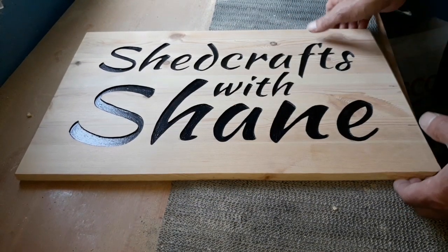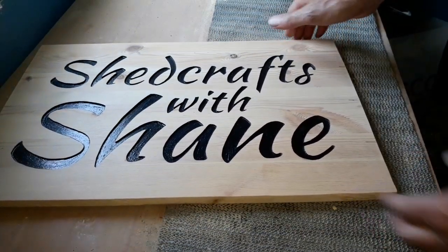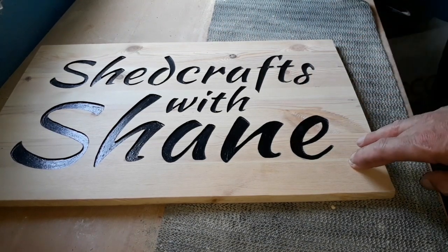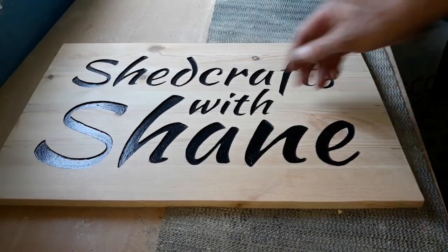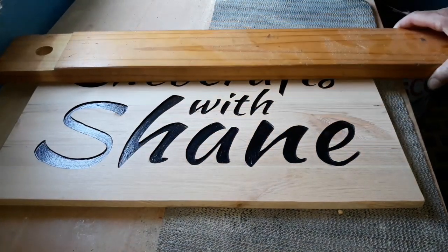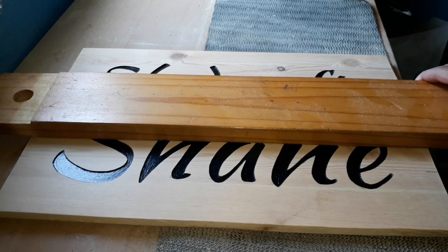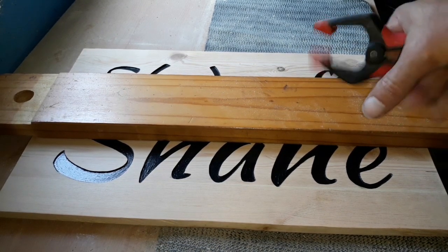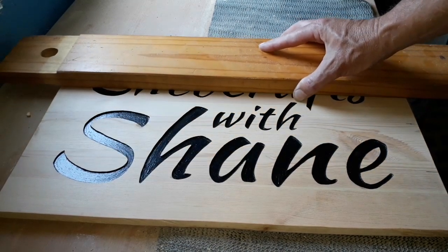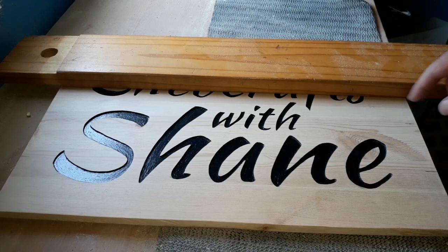That's all sanded down nicely. I'd be quite happy to leave that — put some linseed oil on, a bit of spray varnish, and that would be finished. But I'm going to stick with my initial plan, which is to route out three lines down here to give us four three-inch planks — pallet wood effect, you know what I mean. Normally I'd just do this freehand, but today I'm going to put a border on. I'll put my router on, mark off where I want to be, set a runner in place, clamp it into position at either side, and just run the router along. Once done, I'll move it up, get the positions again, clamp it down, and do the same again — hopefully three nice straight lines.